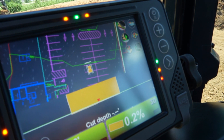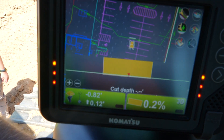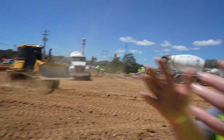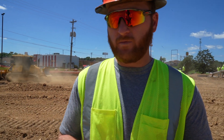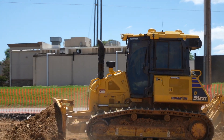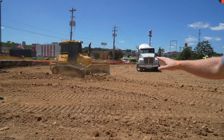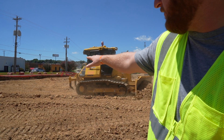There's Sam's dozer in the parking lot — that's what we've been working on all day, so he can see his slope percentage and where he's at on the job. Now it actually looks good — the base rover here with the guys, basically running off the base pole doing all this GPS: point-taking, stakeout, surveying, elevations — all in one. Sam is getting elevations worked in on the same screen, setting his auto-blade, and as you see, that blade moves for him. He's not in there rotating stuff by hand — the blade is completely automatic and he's just making minor adjustments. Behind him, it doesn't leave a windrow — it's all about efficiency.